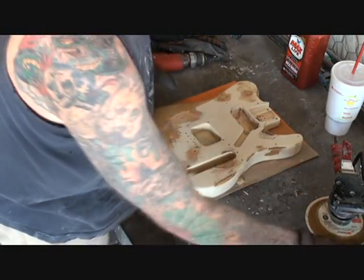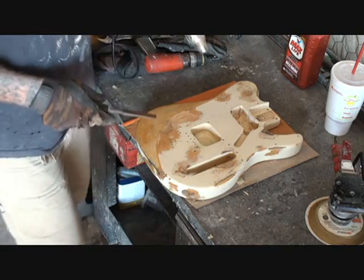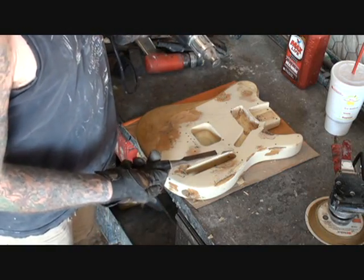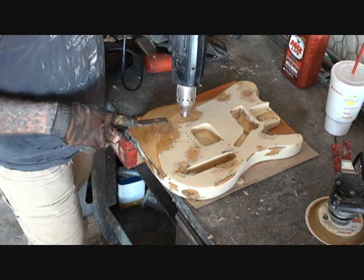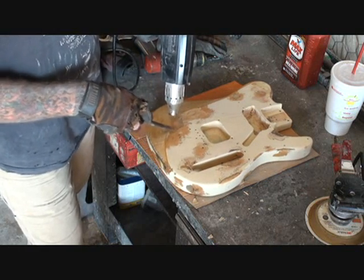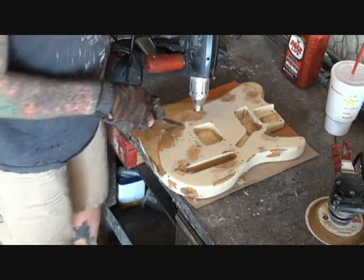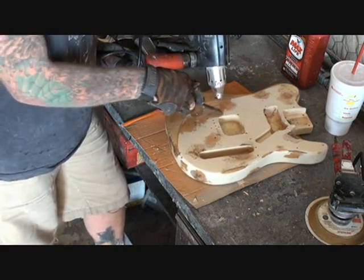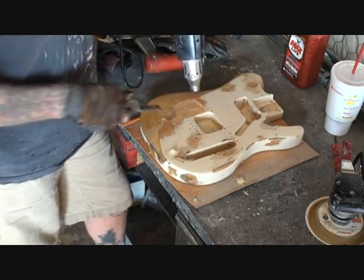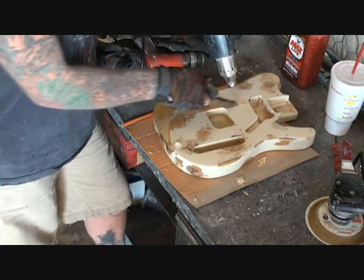The camera's almost ready to die, so let me get to it. On some finishes, especially on ash wood, you can strip it the easy way: take yourself a nice dull but flat chisel and your heat gun. When you heat that paint up, watch close — the finish comes right off. Look at that, it just flakes off nice and easy. I'll do this whole guitar body that way.